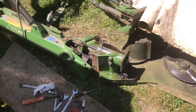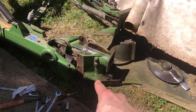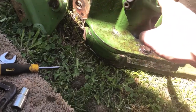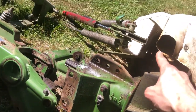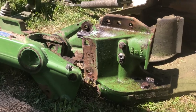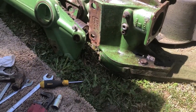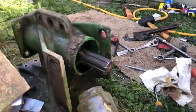This is what happens when you don't take care of things. There is an Allen wrench bolt — I took it off and there was oil coming out, but the oil had a lot of metal shavings. So this shaft — the gears on that shaft must be bad. I'm gonna take it all apart. I had to take off a bunch of bolts on top. More work than I wanted to do — I'm gonna try to access it from here. If I can't get that shaft out, I'll have to take it all apart, lift it up, and maybe take it to the shop to have them rebuild it.